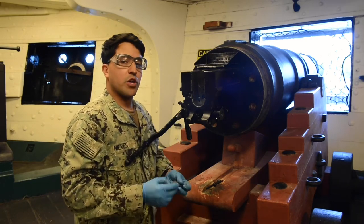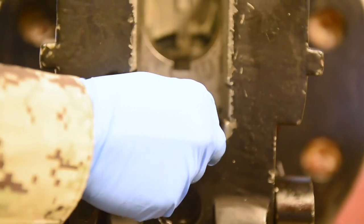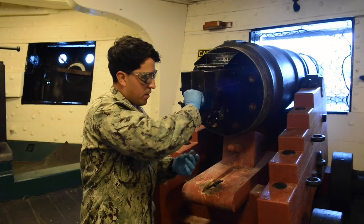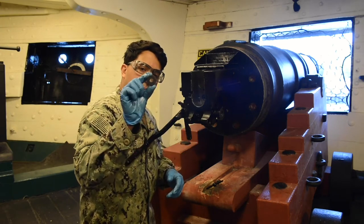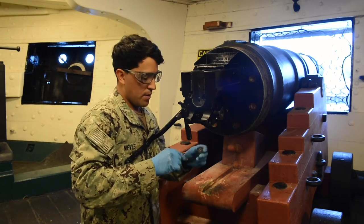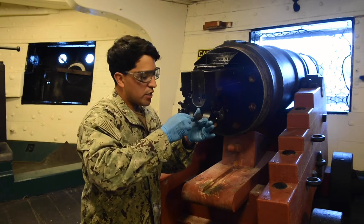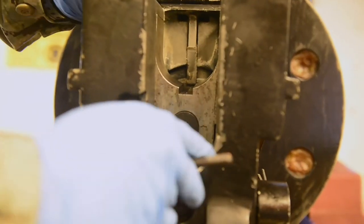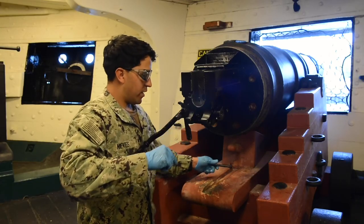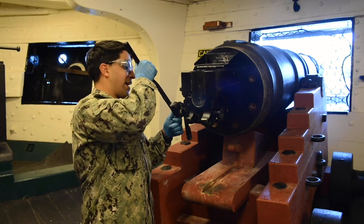Every step in our MRC will show you all the safety requirements — warnings and cautions. Now, take our firing pin, place it inside the back of the breech, followed by our firing pin spring, followed by our firing pin back cover. This cover has a little diamond engraving — put that in the up position. Do a T-striker, push in. There's also an arrow on the back of this breech — line the diamond with the arrow, place it, and push in. It'll be fully seated once that diamond is touching the arrow. Then remove our charging handle and put it back at the 90-degree position.